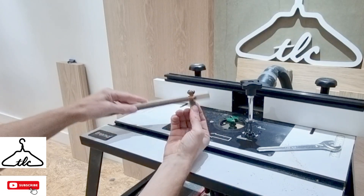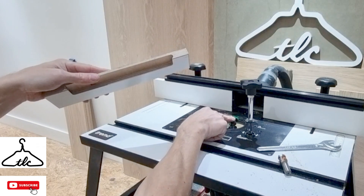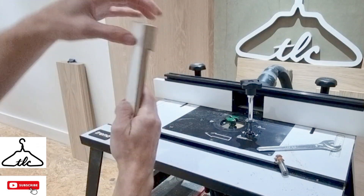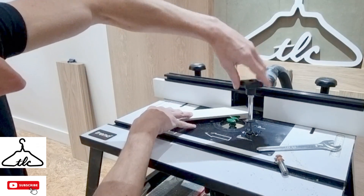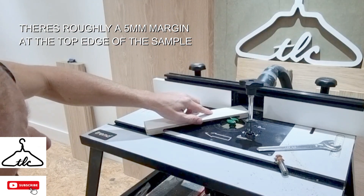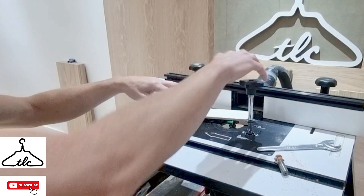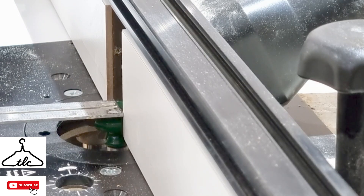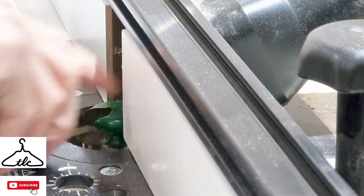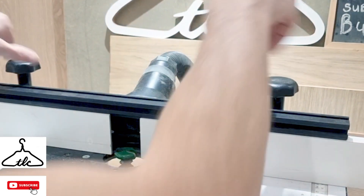The way the cutter works: I'm going to use this as a reference to get the top of the blades in line with the underside of the workpiece. I'm using 18mm material on a bit of scrap, so I'll drop the cutter down until it hits the underside. I'm happy with that. I'm going to have the blade sticking out roughly 18mm from the fence to start with, and I want to get the fences as close to the cutter as possible. I've got the hoover already set up to the back of the fence.